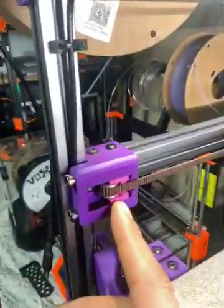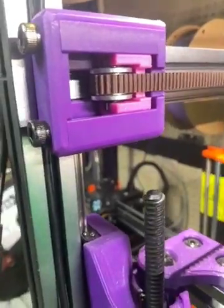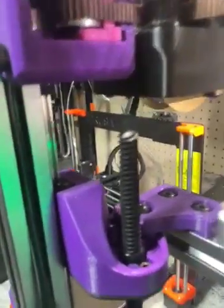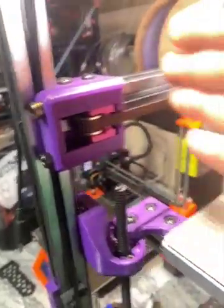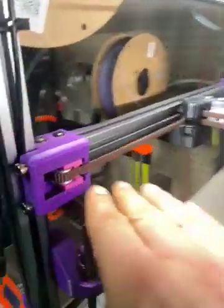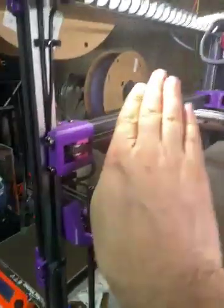Especially on BFI — BFI is harder to deal with than RAMA. On BFI, you want to make sure that through your full course of travel the bearings stay centered. You can see mine — looking at the bearings all the way back, through the middle, and as I pull it forward, it's still roughly in the middle. This carriage needs to be parallel to how your extrusion is oriented — if everything is flat and perpendicular but the carriage itself is angled downward, everything will be angled.